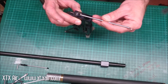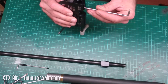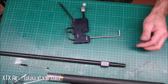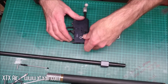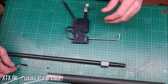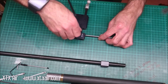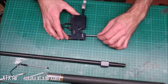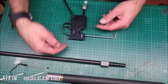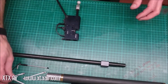Stick a 3mm rod or 3mm drill bit down into the hole if you can't see whether the venturi is closed or not. If the drill bit passes where the venturi screw meets the port, then you know the port is fully open. If not, loosen off the lock nut if it's a mark 1 or 2, then use a small Allen key to loosen the venturi screw until you can pass the 3mm drill bit or rod past the venturi. Once you're happy that it can pass through, lock up the lock nut.